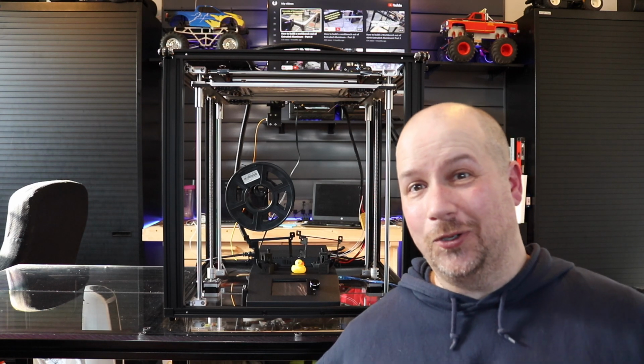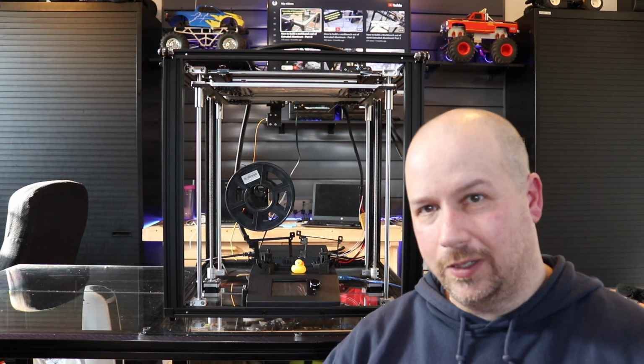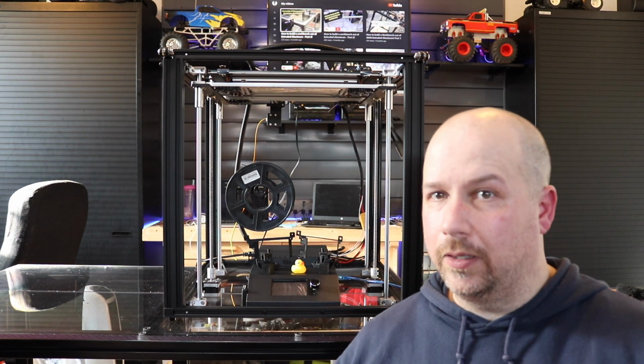It's going to be a movie, I'm sure. So, the Z offset. I converted the Z offset on here in the Marlin display. You've got to bounce around back and forth a little bit, but this one wound up being a negative 2.7. I like using the touchscreen.